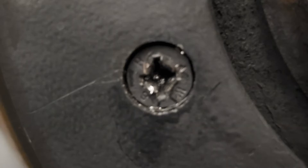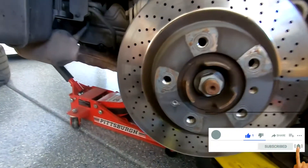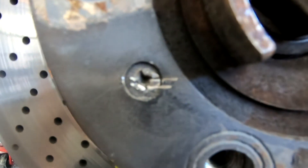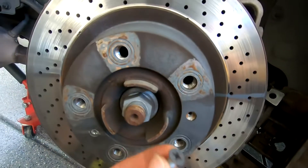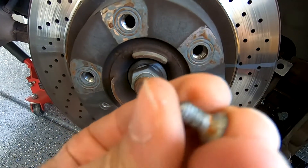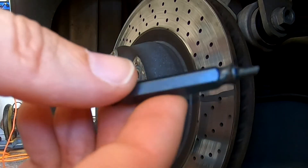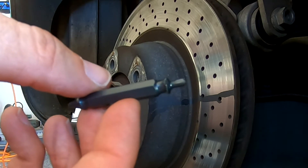Here's the culprit. I tried by hand and it didn't budge. I tried with a battery-powered drill — didn't budge. I tried with a plug-in drill with more torque and it came out, but look how small this is — you wouldn't think it would be in so tight. When I used the plug-in drill it just stripped right through. You drill counterclockwise and it makes grooves in the screw that the other end can bite onto.